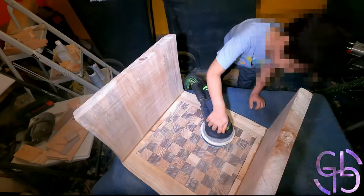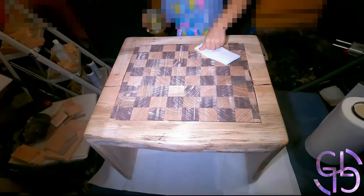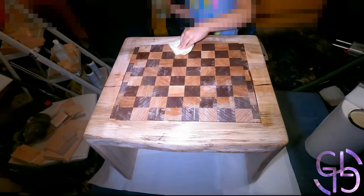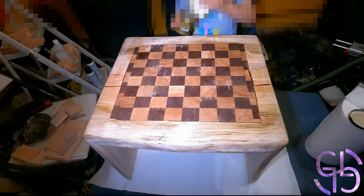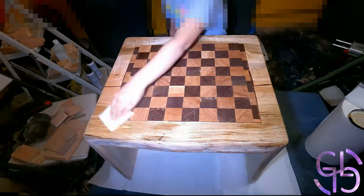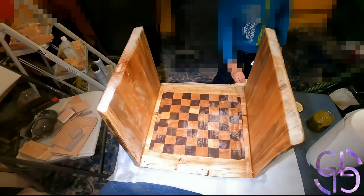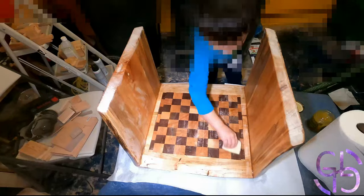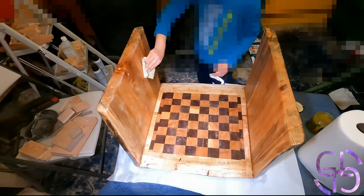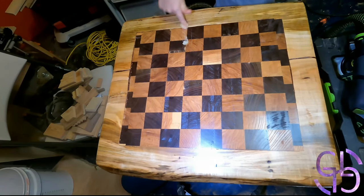Once sanding was done, a very generous amount of oil was applied. We applied a total of 5 coats of oil both on top and bottom of this table. I do not know if it is all the oil we applied or just this wood being particularly weird, but the color of it was much, much darker than the table I made. The only thing I can possibly blame is the fact that this wood drank a lot more tung oil and we put a total of 5 coats instead of 4. Maybe that's the case, or maybe this wood is just really stubborn and likes being different from my table. The last thing left to do was to wax it. My son really went overboard with wax here, but I wasn't going to stop him — the excitement in his face was too much. I let him go ahead and apply 3 very generous coats of wax. My poor wax container was almost empty but the excitement in my son's face made it all worth it.